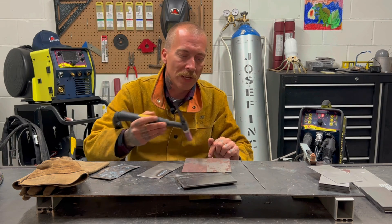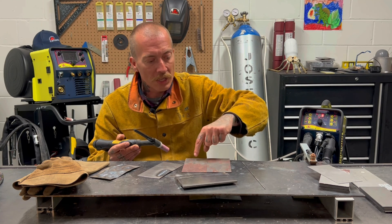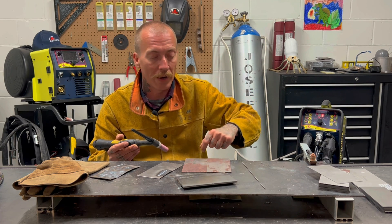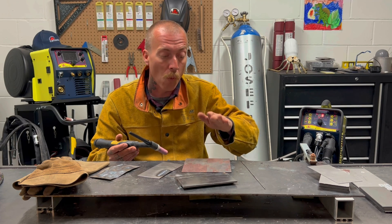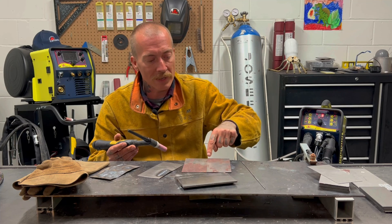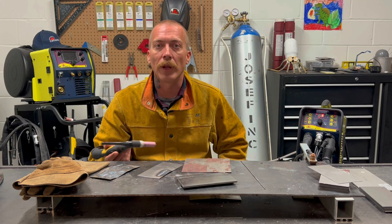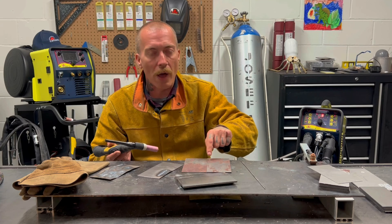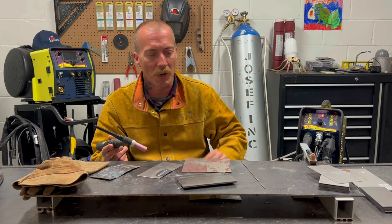If you're coming along like this, by the time you get to the end, the heat's got no more place to go. You've chased it all the way to the end and now you're super heating that metal. If you're not paying attention and not using a foot pedal to slowly back it off, you can end up burning a giant hole down there. What was the perfect amperage at the start is going to be way too much at the end — that can be tricky when you're learning to TIG weld.